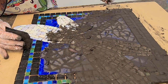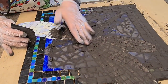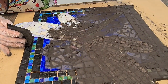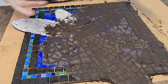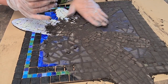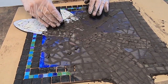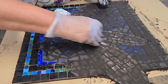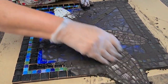That tells you it's set quite nicely — but there's no need for a rush. Just make sure you remove any excess grout, which I'm doing now — pushing it over to the other half. If it does dry too fast for your liking, you can always lay a damp cloth over it, just to keep it moist while you're ready to clean it off. See how it's drying nicely here — that's the way I like it. It's less grout you have to clean off; otherwise you're just clogging up your rag with excess grout. I've basically just moved all my excess grout over to this side, keeping an eye on it — it's not drying too fast.